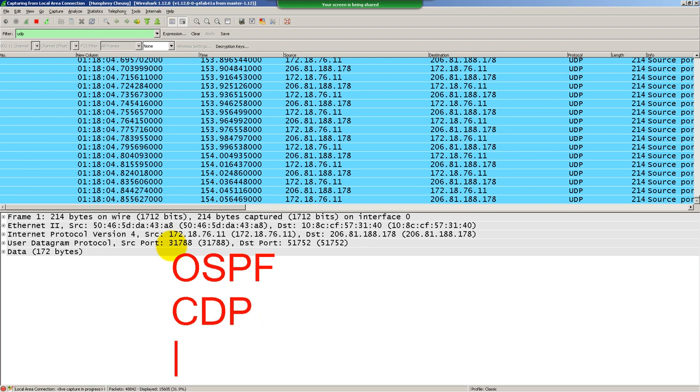We saw CDP. Now CDP, I know in a lot of books they say disable CDP because of security, but the problem with disabling CDP is you are going to render a very expensive tool obsolete. Like it won't work anymore. That's the Fluke. Those nice expensive yellow things, $2,000, $3,000. You plug it into the port and it will tell you the port on the other side. Cisco 6509, port 9/11, gigabit Ethernet, blah, blah, blah, right? And you need this a lot because the ports aren't labeled. No one put the sticky note or the label maker on the port. It's just orange. You don't know where it goes. Right? You connect in, you get a light, but what's the other side? So if you disable CDP, you're going to miss a lot.